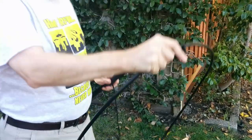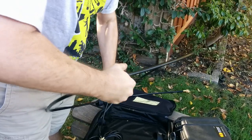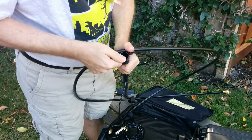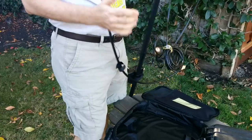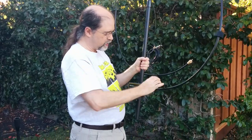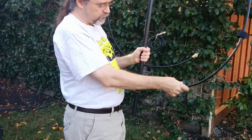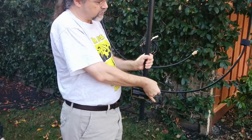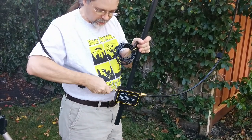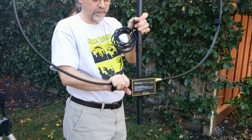Oops, it's caught on this. So you put the back in first, like that, and then slide the coax on. Now, you take this PL259 and put it in the SO239 here, making sure that it's nicely aligned. You can push down a little bit from the tension, so you want to support it a little bit to make it straight. Same thing on this side — make sure that it's aligned properly and just screw it on. This is no different than putting on any other UHF type connector.